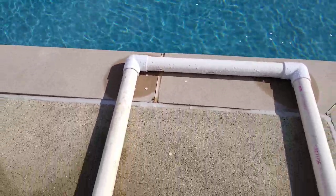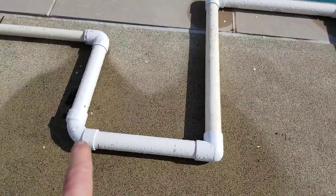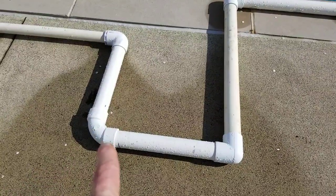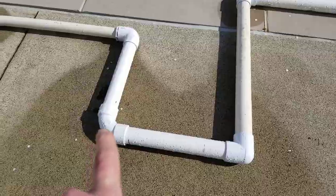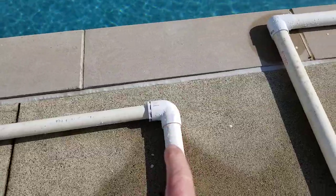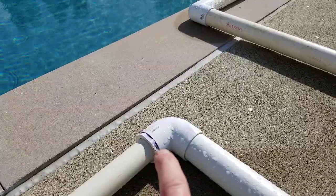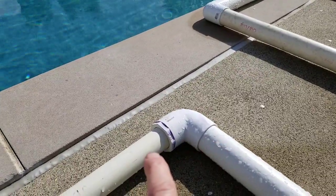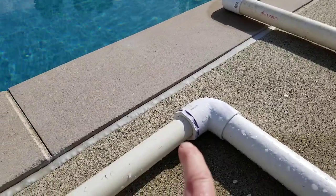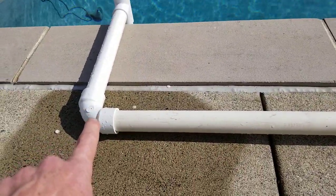So there's another elbow, another length of pipe, another standard elbow right there, another length of pipe. Here's a sweep elbow. You can see this has a little more generous radius to it, a little more gentle turn, which results in a little less pressure drop. I have another straight length of pipe, another standard elbow, and then you can see there's a reducer bushing right at the outlet of this elbow that reduces me from 2-inch pipe over here to 1.5-inch pipe here. So now I have a tighter restriction, and I'm going to have a higher average flow velocity through this last little bit of pipe. I have another sweep L, 1.5 inch.